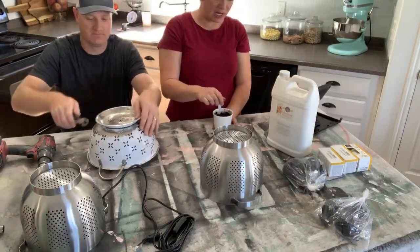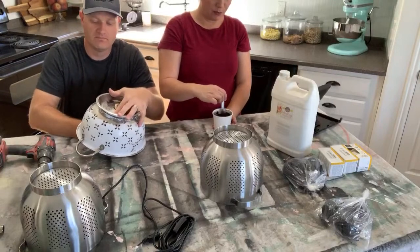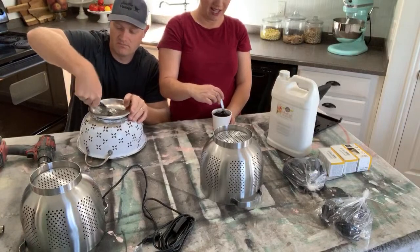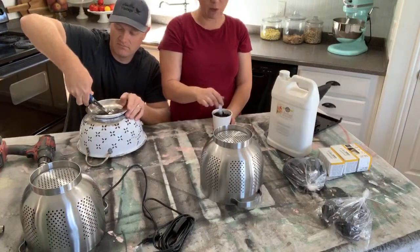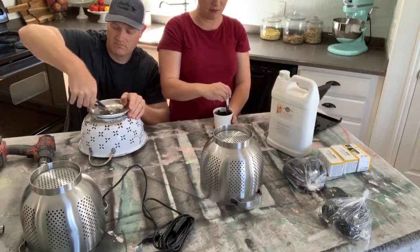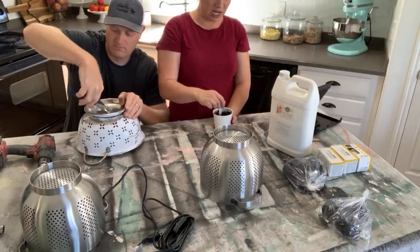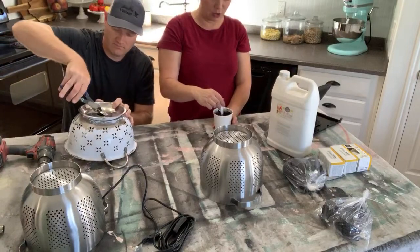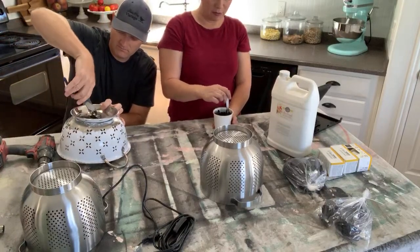Can you put milk paint over chalk paint? Yep, you can do it all the time. If you want it to not chip through the chalk paint, make sure you seal that chalk paint and wait 48 hours — and even then sometimes it'll chip through it. We have a video where I did the buffet in my bedroom. Search 'Jamie Ray Vintage buffet' — we used DIY paint under the flower sack and I have bits of apothecary peeking through my milk paint and it's really pretty.